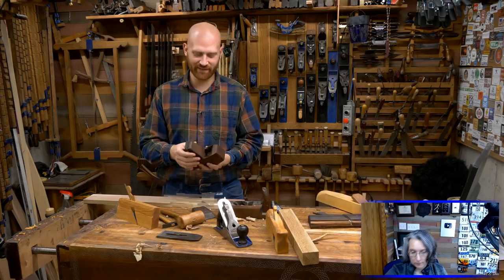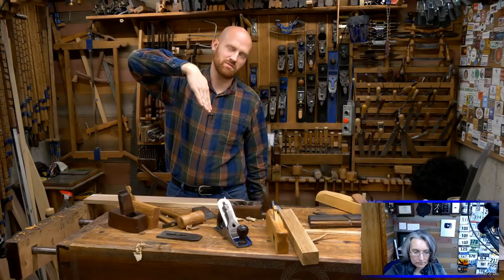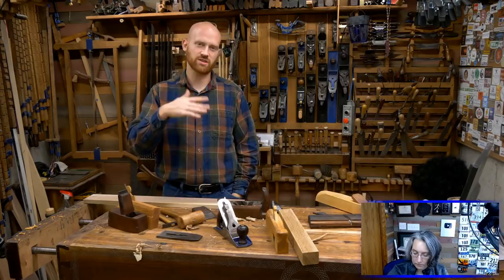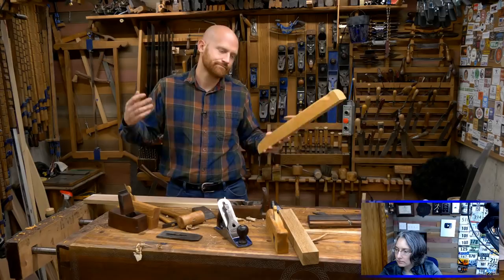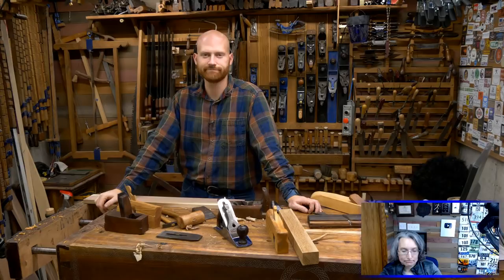Adel Shaw asks: can we make a homemade toothing plane? A toothing plane is exactly the same as any other wooden body plane — you're just changing the bed angle from 45 degrees up to about 90 or 95 degrees, since they go past vertical. There's no chip breaker, so it's even simpler to make. The hard part is finding a toothed iron — antique ones are harder to come by, and it's often cheaper to just buy a whole toothing plane than to buy the iron alone.